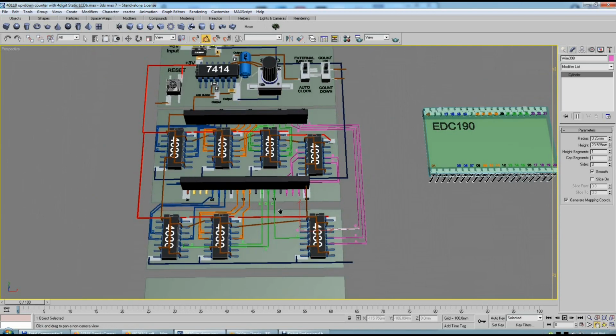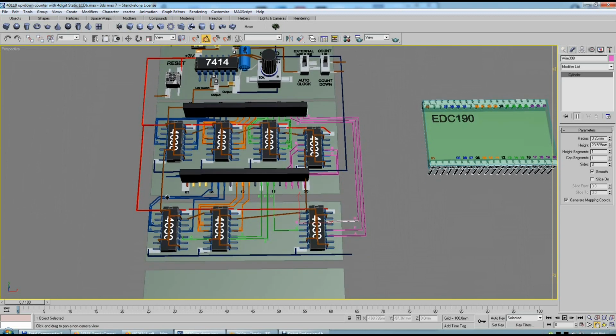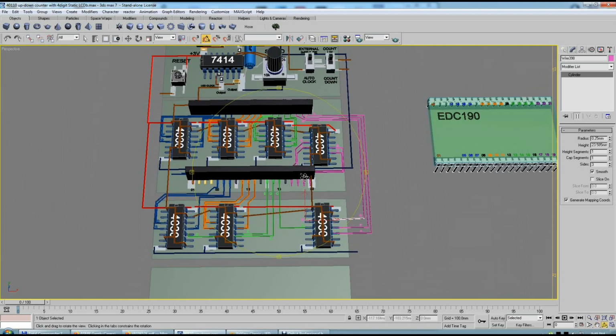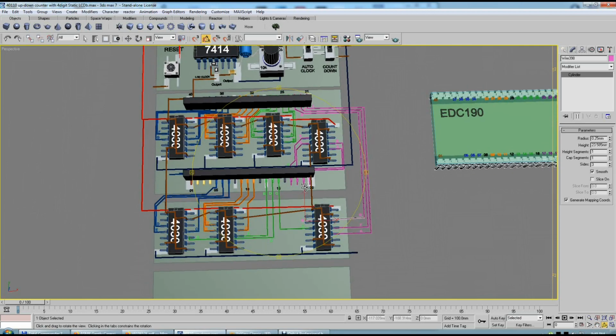While if you have to repair something here, you can repair it. If you have to change something, you can change it. If you have to debug something, like I already debugged it, and I figured out that these chips are not actually compatible with the other 4030 with the 7486, I think it was. They were not compatible at all, but they are compatible if they are from the same batch, from the same family of chips, the 4000 family in my case. And yeah, that's my suggestion. That's the direction I'm taking with all these things.